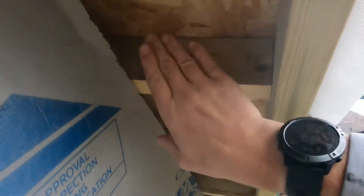I'm going to put insulation in between here because this would be a cold spot if I put ply up there, and we don't want cold spots in any of this. If you get warm air rising and it's cold inside here, it will condensate — and we don't want any of that.